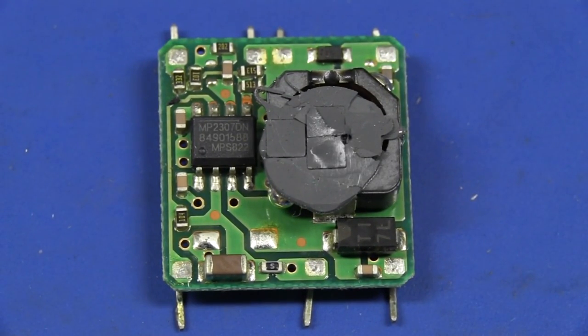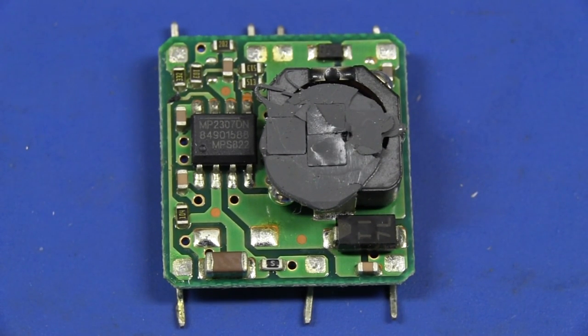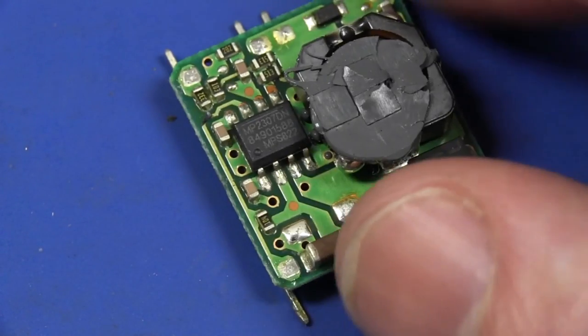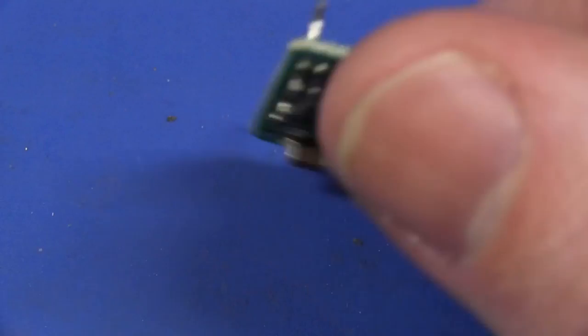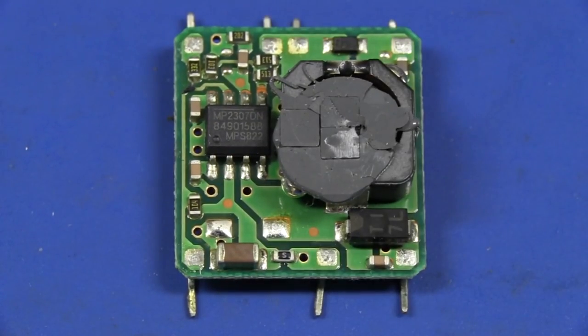And I just checked that MP2307 is a monolithic power step down converter. Nothing fancy at all. You know, 90 something percent peak efficiency, it can have 0.9 volts to 20 something odd volts output. And well, it's not exciting at all. I think Jeff, was it? I think he mentioned he wanted me to test these on the dummy load, but quite frankly, couldn't be bothered.